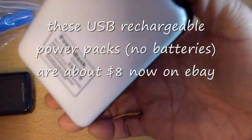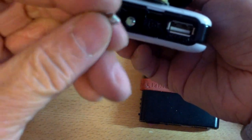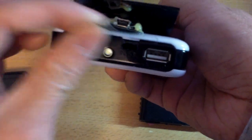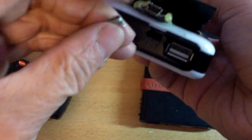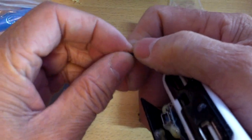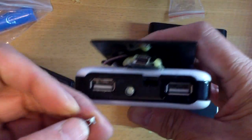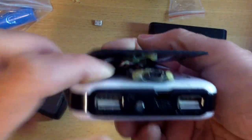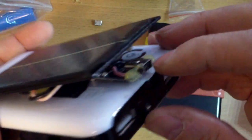This is the new one — it looks very nice, smooth plastic. The only thing I don't like about it is the micro USB connector. The last time I used it, I pushed the connector in and it somehow disconnected from the board. I think it was glued on rather than soldered, so it's extremely flimsy. It got disconnected from the charging board, making this thing completely useless.